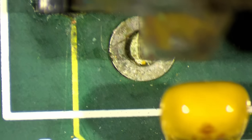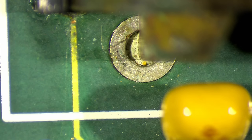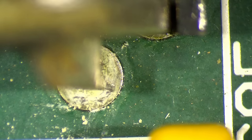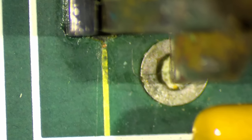I could try to fix this board without removing the keyboard connector, but you may already see that there is a lot of stuff in those big vias here. I want to get all the solder out and try to reuse the connector for now because I don't have spare ones. But I ordered, I think, 20 pieces now. I have probably 5 boards that need new keyboard connectors, so that should be sufficient for some time. And then we can hopefully try to test this board.